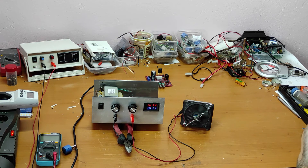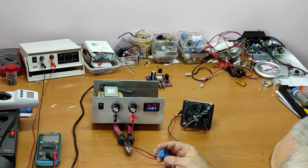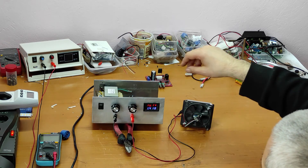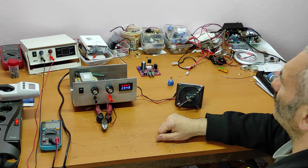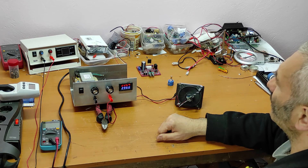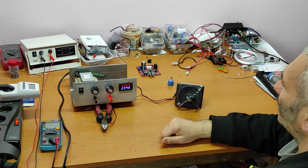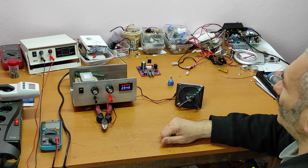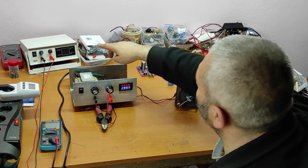I've replaced the faulty potentiometer — I wrote 'bad' on it — and now everything works perfectly. I think my next video will be about the multi-turn potentiometer, what it's made of and what's inside. If you want to see it, please follow my channel. Now let's set current to the maximum. As you can see the voltage drops linearly. With the bad one, you can see it jumps from 1 to 30 volts. As you know, I've made a lot of SMPS power supplies, and if you need, I can make a special video about the advantages and disadvantages of linear versus SMPS power supplies.